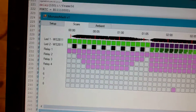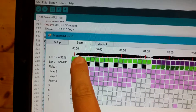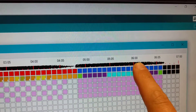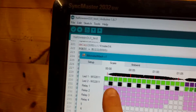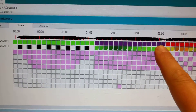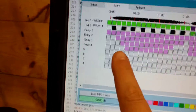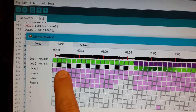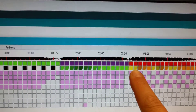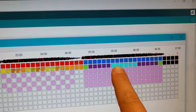We'll have 2 strings of RGB LED lighting within the box. As you can see on the timeline here, which shows the sound file which is only 7 seconds long, LED strip 1 will have 10 lights — it'll go green, purple, move to red and then to blue and then black out. On LED 2 we're going to be strobing from white to black, dim down the green, fade out, fade in, and then some yellow to orange transition and then just a little bit of multicolour rainbow.